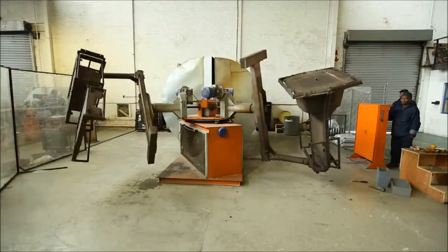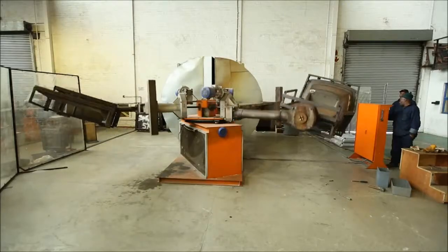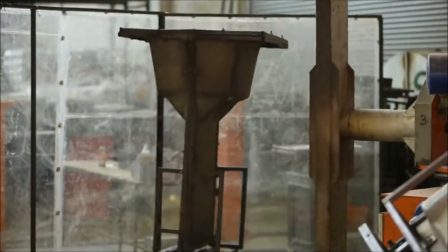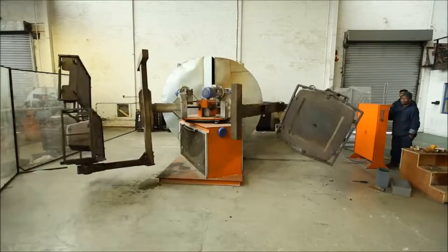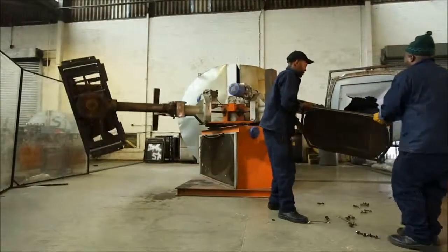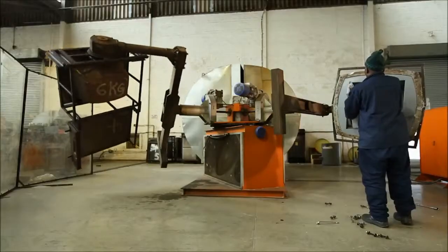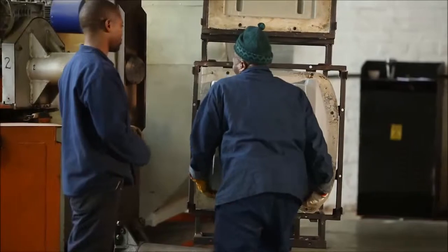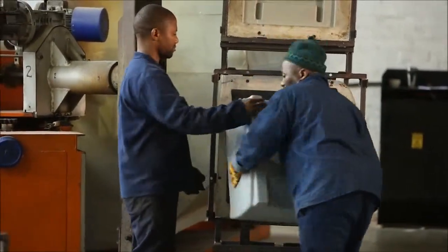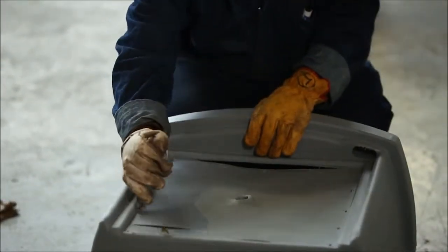To ensure an even wall thickness throughout the product, the arm rotates for 2.5 minutes in a forward and reverse basis, and also spins on an X and Y axis. While the first arm is in the oven, the second arm is cooling, and the third is stripped and reloaded. This continuous and simultaneous 3-part process allows us to produce one product per mold per hour. To ensure a neat finish, the product is trimmed while hot as it exits the mold.